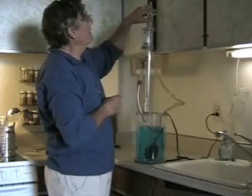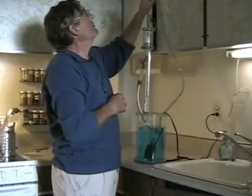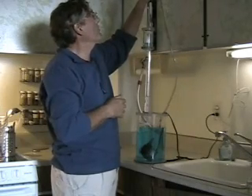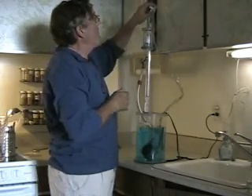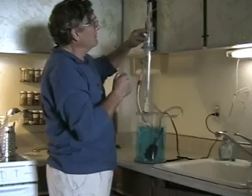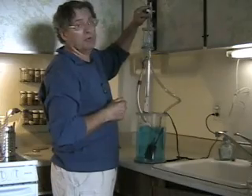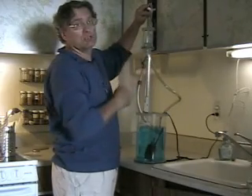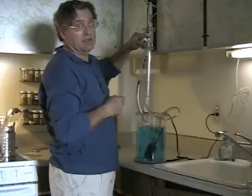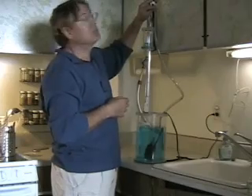You can see that for a line that comes into the top of a tank, there's pretty well always going to be a part of that line that's under vacuum or has pressure below atmospheric. The position of the zero pressure point occurs at a level a little bit higher than the level in the upper tank. That's due to friction in the system. If there were no friction, I would expect to see zero pressure at the same level as the upper tank. Since there's always friction, there will be a difference, and that difference corresponds to the friction head.